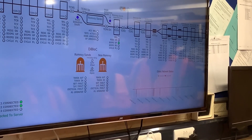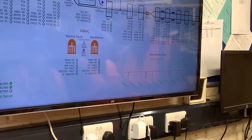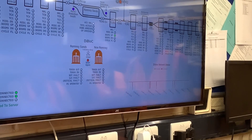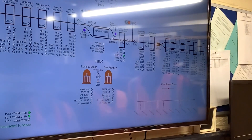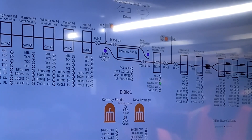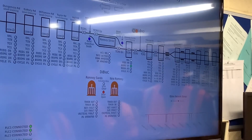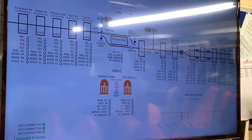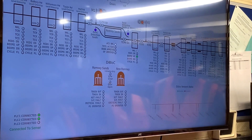The two arrows at the top, where it says approach control direction, turn green when there's a train approaching. TCM1, just below, and TCM5 at the other end of the Romney Sands group are two striking track circuits. The approach control only allows one train at a time into the station, but if you had two trains arrive at pretty much the same time, standing here you wouldn't know which train had struck in first — so that will light up and tell you which train struck in first. It also tells you when there's a train in the platform.